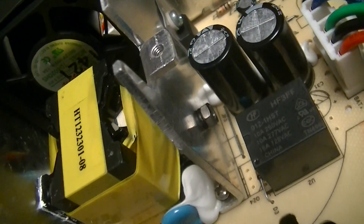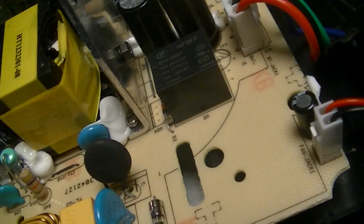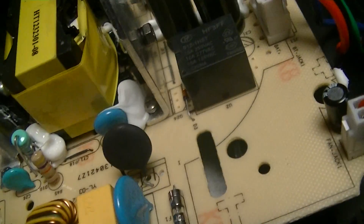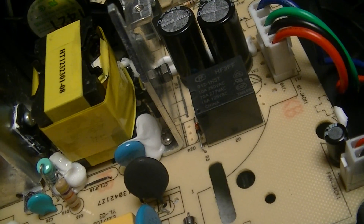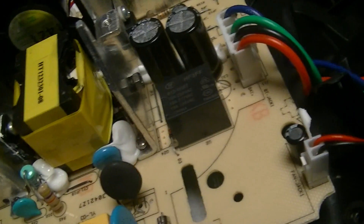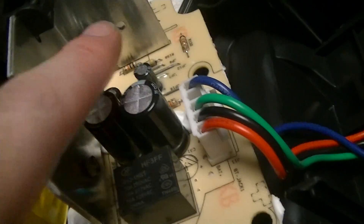There's an LM317 — that's probably the regulator for the microcontroller on the other side, because obviously an LM317 doesn't work at 60 volts. This is a 56-volt nominal battery, but fully charged the cell potential would be up around 58 volts. I wouldn't be surprised if this thing outputs about 60 volts to account for wiring losses.